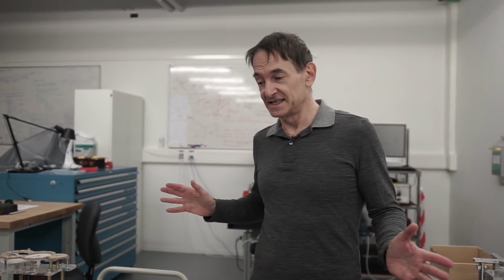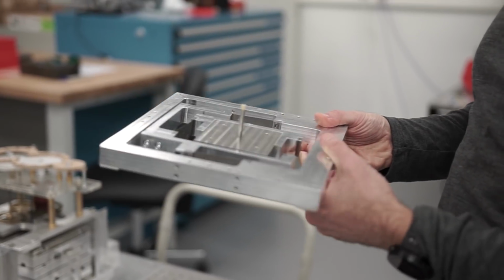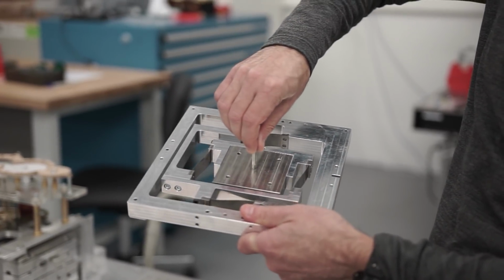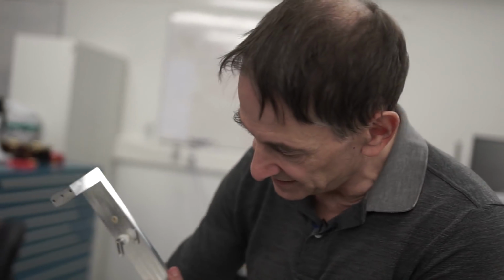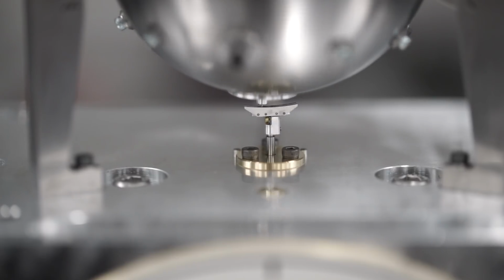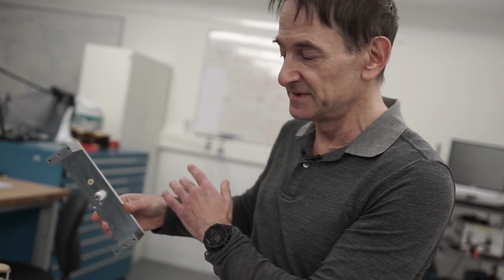However, our new concept was to have an oscillator like this, in which you have 2 degrees of freedom. So you can go in one direction and you can go in the other direction. Once you do that, the oscillator can move in a unidirectional trajectory, like a circle or an ellipse. Once it moves in a unidirectional motion, then you just use a crank, and this pin goes inside the crank, and you just turn the crank, and it's the crank that keeps it going. So that whole complicated Swiss lever escapement has been replaced by just the crank. So you've simplified the escapement.